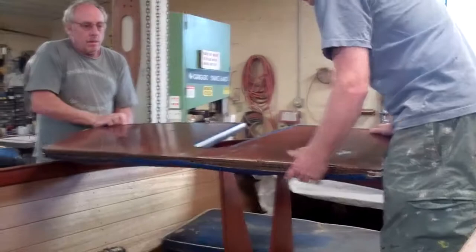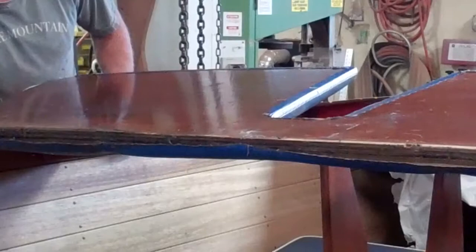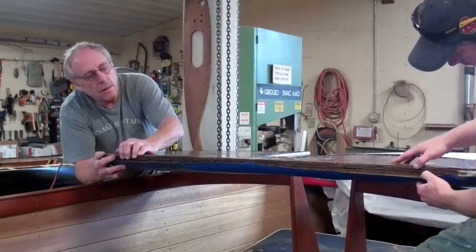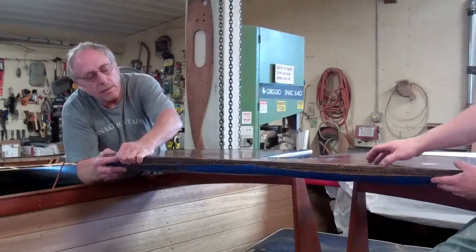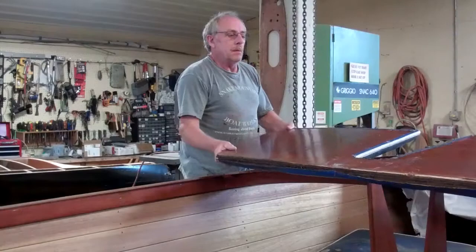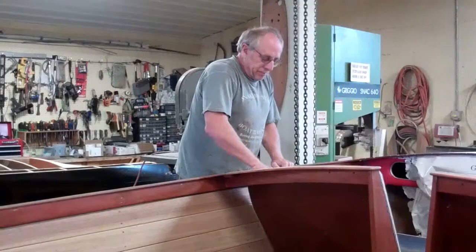This piece of plywood sits right on the floor, and we noticed that water has wicked up in here and actually delaminated it all the way up into here, and it's working its way up the sides too. Down here the plywood is well over an inch thick, whereas this is only three-quarter inch plywood, causing a dry rot problem in the plywood between the layers. To try to save this piece is a lot more work than just making it new, and it's going to continue to rot.